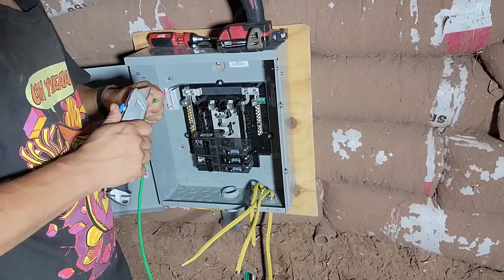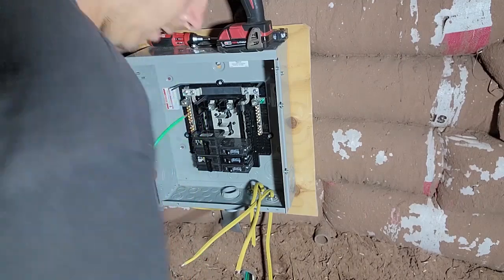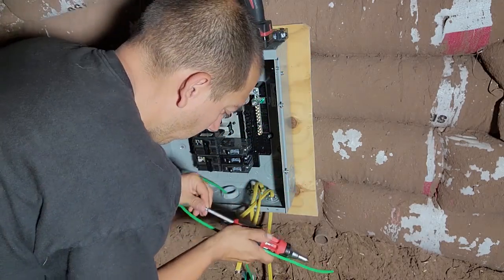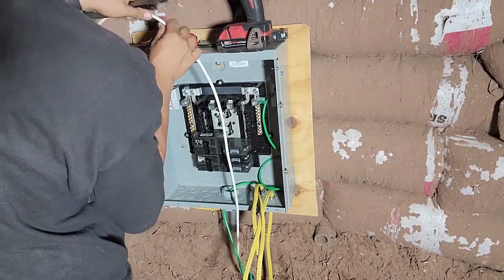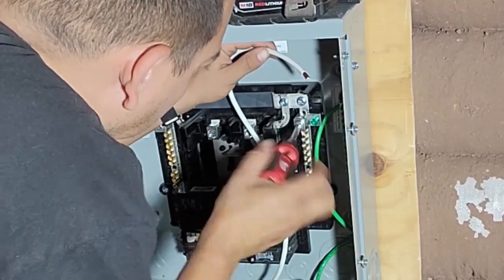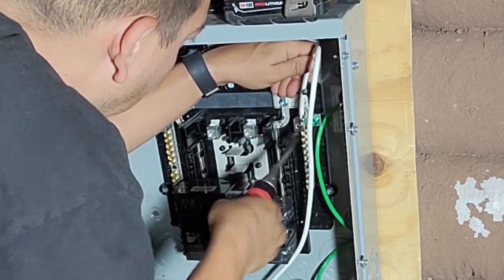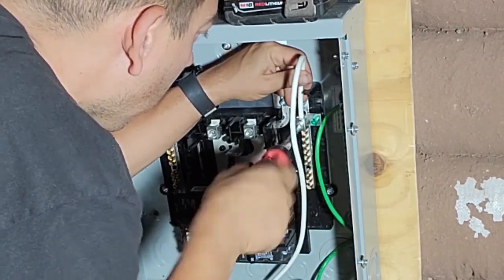The reason is if you make a mistake and accidentally get glue onto the wires, that could eat through the coating and then cause a short. You can be careful and put a little bit of glue on and then put the pipe together, but then you might underglue the piping and more moisture can get in there. That is one area where I didn't want to cut a corner. I wanted to make sure the wiring to our house was done right and secure, and I'd never have to worry about it again.